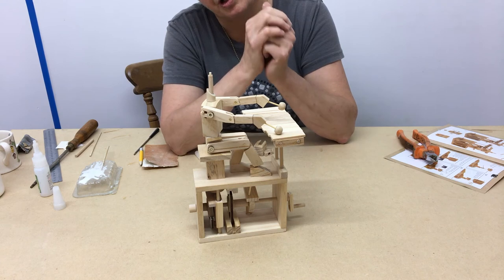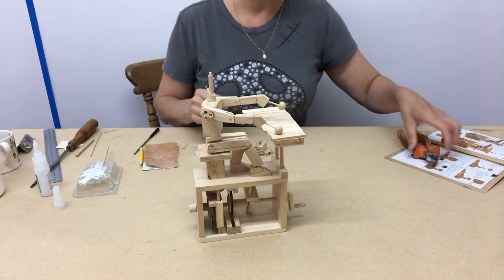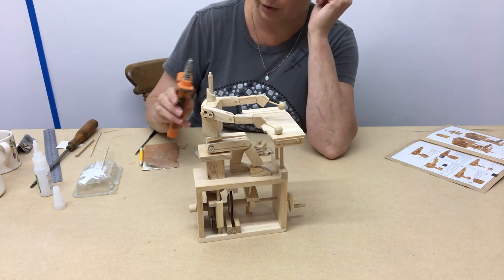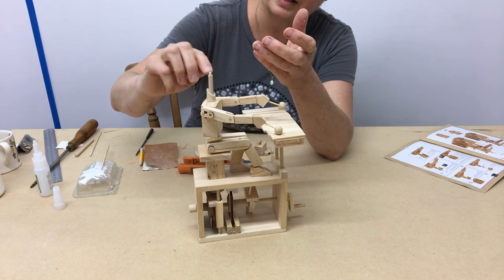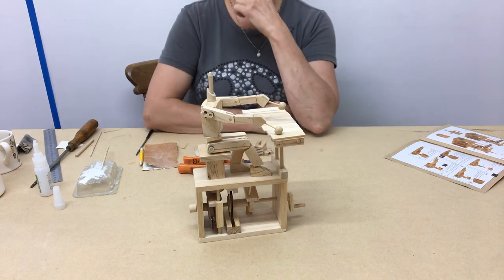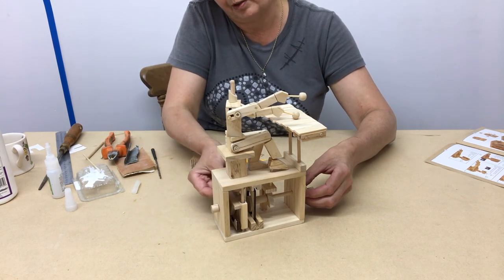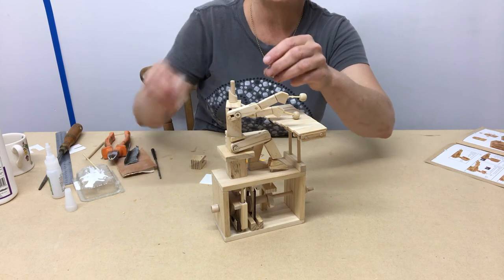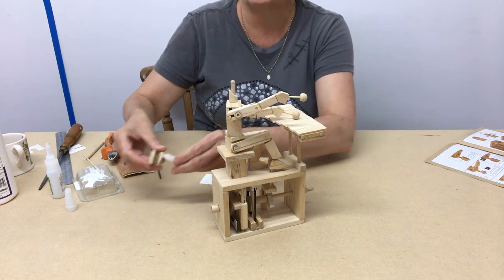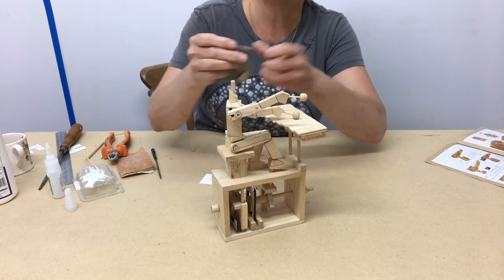Leave for quite some time to dry. Once it's dried, you need to make that level — it's probably up to 2 or 3mm sticking out of the top. If you've got some little snippers, snip the top off and sand it down, or try and get some rough sandpaper and just sand it down level with the top of that space. With the cam in its lowest position, wax this sloping surface of the neck and the same with the underside of the head — wax that and really buff it, very very slippery, because they're going to slide against each other.